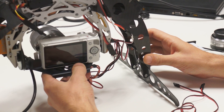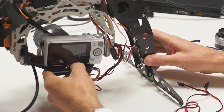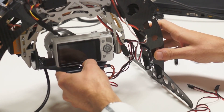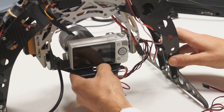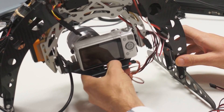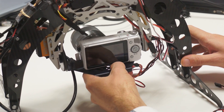We found that placing them beneath is the cleanest way to route this wire, because now the wire moves together with the RSGS and the trays, so there is no change in angle between these two parts. So wherever the gimbal moves, those cables are safe.